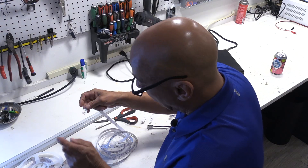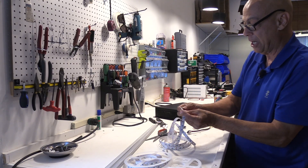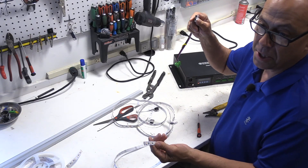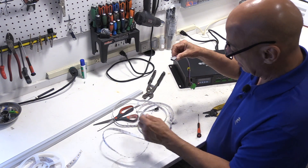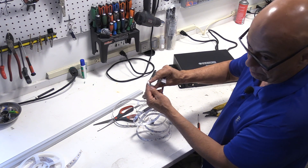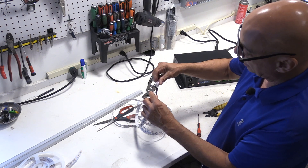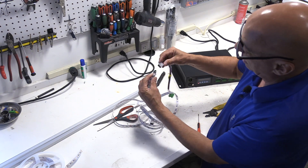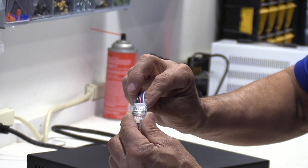If you're not really handy at soldering, that's what these connectors are for. The tape is polarity sensitive, meaning you can't just plug this in from either side. On the tape you'll see little letters and a plus sign. The plus sign goes with the black, and the letters correspond to the color — you have red, green, blue, and white. Right now the plus is on the bottom, so if I plug this in it will not work because it's sending the white to the plus.